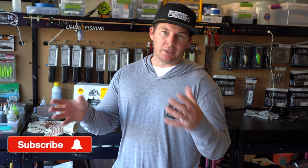A lot of the videos have, you know, whoever's putting the video on, like myself, tells you how many drops of colorant they're using, or how many teaspoons or half teaspoons they're using of different pearl powder or glitter or something like that. So do some research, get some generalized recipes, or just get in the garage, go play around, and if you mess up, you mess up. If you end up going too thick on a color, you can always dilute it down with more Plastisol. So there's really nothing that you can't mess up beyond being able to fix unless you burn your Plastisol. But if you do something where you end up putting too much colorant into your bait and it's just thick and it doesn't look right, you can always remelt that bait back down, add more clear Plastisol to that bait, and it's gonna start to dilute that color down and make it not so thick and closer to what you're going for.